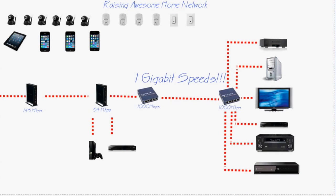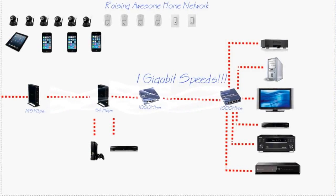What switches do is allow traffic to go through one wire to multiple devices. Switches are much faster when you hardwire things than using wireless — up to a thousand megabits per second, or one gigabit speeds. This would be more than enough, because it doesn't even come in that fast from the internet provider. The trick is getting the wire to the back of the house.